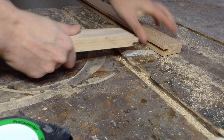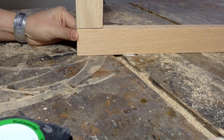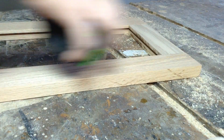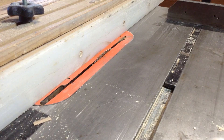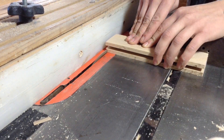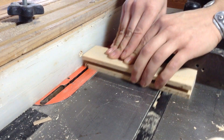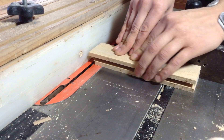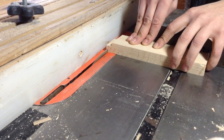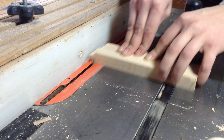This is the final one — it fits in there nicely. I usually do one measure to make sure it's perfect because I have cut my rails wrong before. I measure to make sure it's the thickness I need, and then I take all of those rough-cut pieces to the radial arm saw, cut them down to final size, and put the tongue on them. Once you have all of those kerf cuts, you can slide this across the top of the blade, and that will create a nice even surface for your tongue.